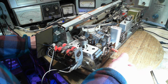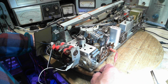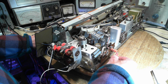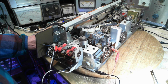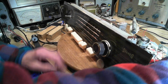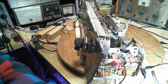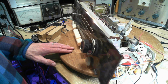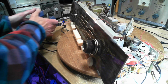Okay, ungrounded, a fair bit of volume. And then if you hook up the ground, which is a better way to operate with this kind of antenna, by the way. Folded dipole antenna. Let's leave it like that. Volume is low because the antenna signal itself is relatively weak. The idea with this antenna I use is you get a little bit of a weaker signal, but you get much less noise. And the combination is just fine. Let's just turn this up a little bit.